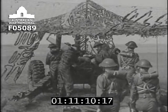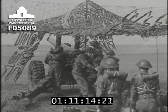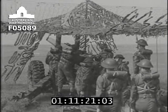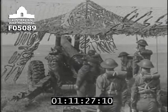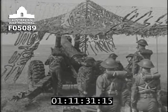The 5.5 and 4.5 guns are breech loading, or BL, equipments. This means that the charge, which is contained in a bag and fired by a tube, is loaded separately from the shell. One of the jobs of the breech mechanism is to form a gas-tight seal to prevent any rearward escape of gas when the gun is fired. This sealing process is known as obturation.